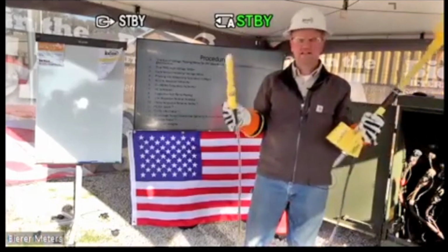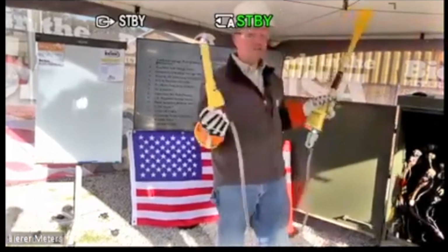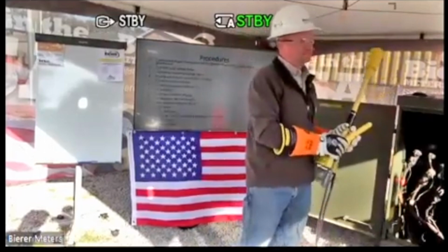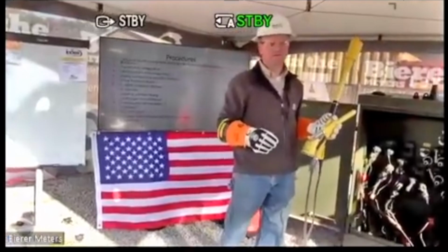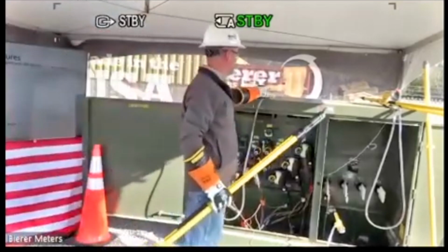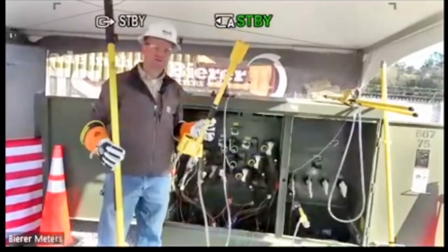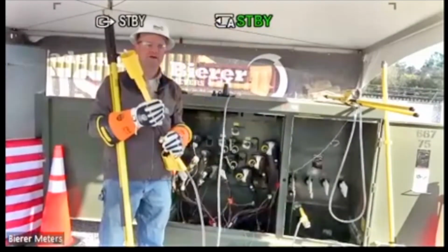It's exactly like you're going to high pot cable. So if you're used to high potting URD cable using a traditional phasing meter, that's how you would high pot an arrestor. So we're going to go ahead and high pot this exact same cable we just put the DC cable tracer on. With high potting primary cable, as I just mentioned, I want to always put my high pot to the energized source.